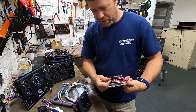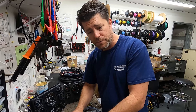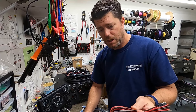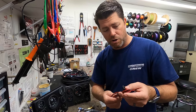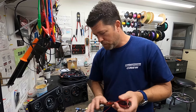For setups that have those additional parameters, sometimes when we pick off sending units with the two-pin molded connector, we also provide a short two-pin brown and red harness that allows you to connect to those additional sending units on your engine. This particular harness is meant to connect to both the boost pressure input and the gear temperature input. When you purchase this system, those instructions are included.